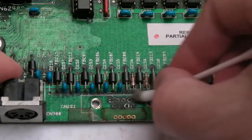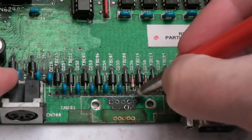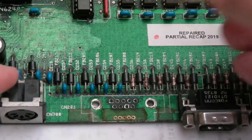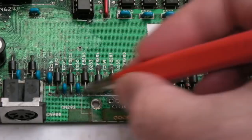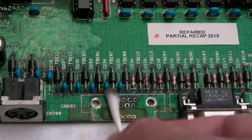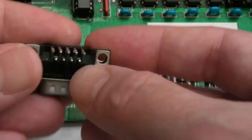But before we do that, where's the fiberglass pen gone? Yeah, it'd just be wise to just do this. There you go, you can see the corrosion coming off the surface. I'm kind of pleased that I'm revisiting this, to be honest, because you know what? This is something that I should have done when I did the repair. You could argue remove all these, but I think, if anything, it's just going to be some conductivity as a result of a bit of rust and corrosion around there. Anyway, that's had a little bit of a clean now, so let's get some flux on, tin them up, and then the solder will make a nice bite when we solder this back on. You can see that all of the horrible solder just came away along with the corrosion. So I've got no concerns about putting that back on.